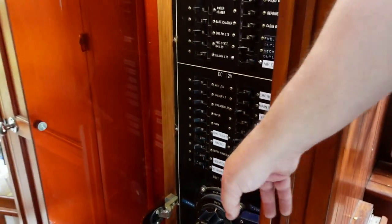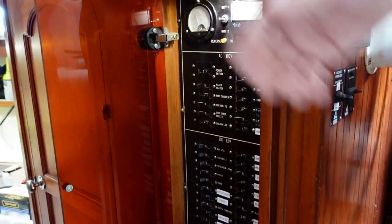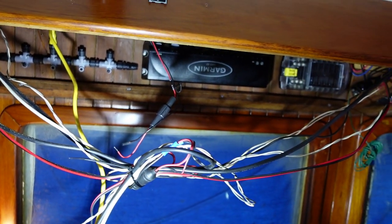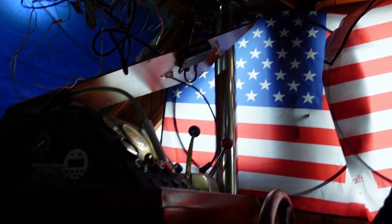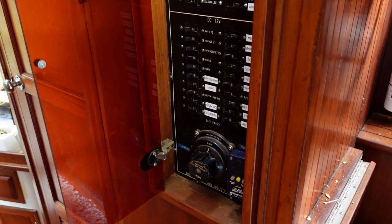So that way when you throw that breaker on, you have 45 amps worth of power at 12 volts or 13 volts to the Blue Seas. And then from there, you can take it off each branch to power all the individual components. Wow. I'm so glad you know how to do this. Yeah, it's probably wrong, but that's all right. There's no perfect way.